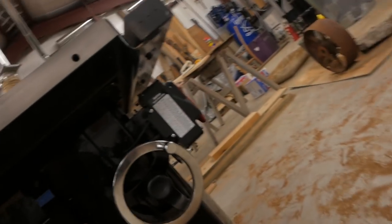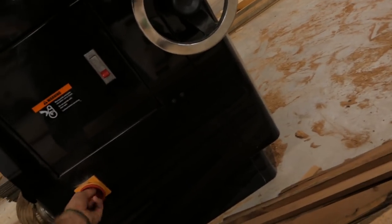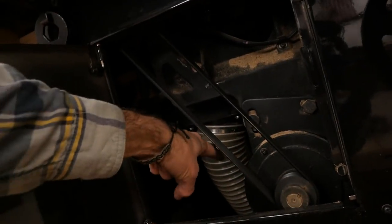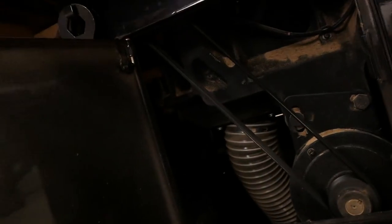So let's open it up real quick and see what is inside. Comes with the wrenches — a couple really nice wrenches. You've got an on-and-off switch on the industrial that you can lock, which is great for me because I have kids running around in here. Three horsepower motor, dust collection there which is really nice — I'll show you more detail on how that works. This saw is a lot like a foreign or Japanese car; the inside is packed full of components and parts, but they're really well designed and thought out.